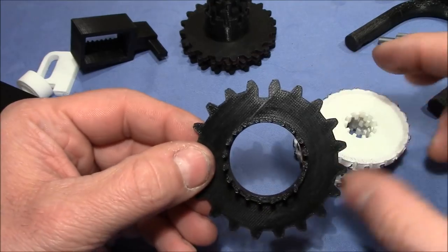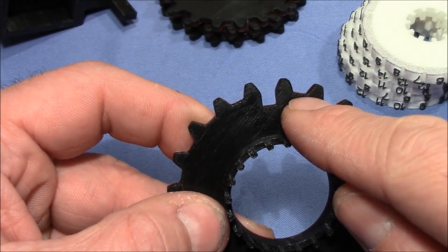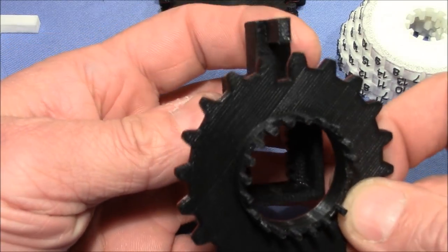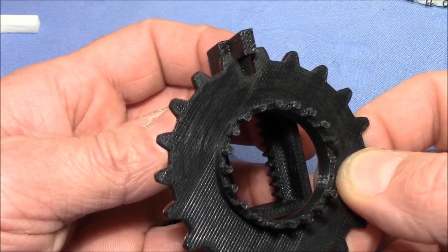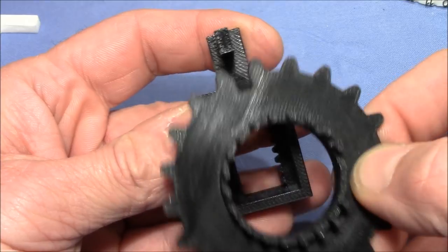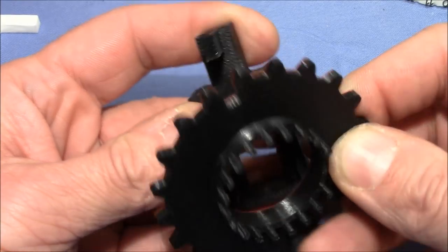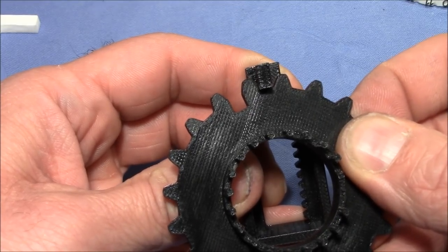I could assume that a prototype made from metal would operate very, very smoothly. Let's pick out one of these inner wheels — one of these code wheels. We can see the true gate and the false gate; both have the same width. So when you try to test, you would not feel a difference in left-right movement. What I was looking for was a change of resistance — in a true gate, the inner wheel would be easy to turn in this gap, while on a false gate it should rub on the contact area. But actually there isn't much friction here; it's really smooth, so it's really easy moving left and right.